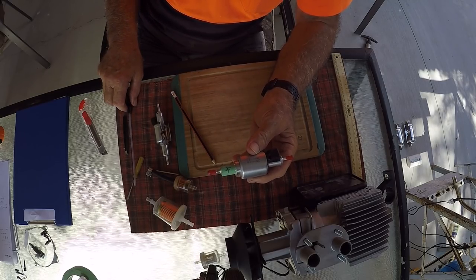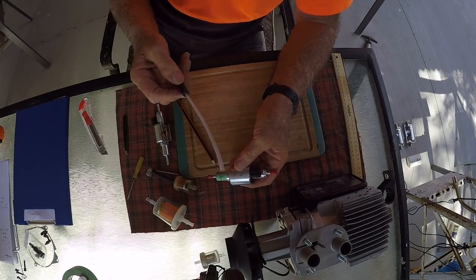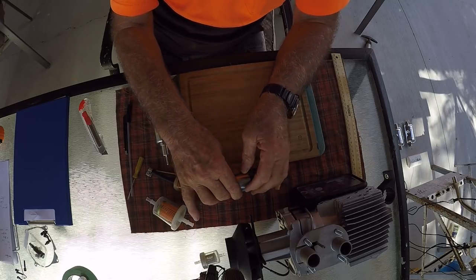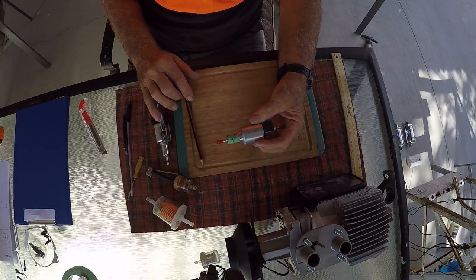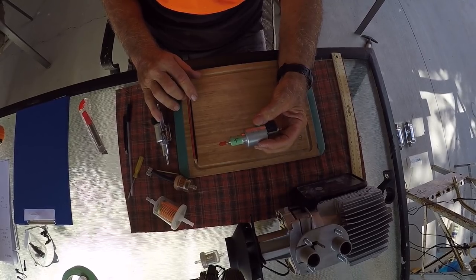When you mount them, you rubber mount them to isolate that noise, and you also isolate the fuel hose. All right, I hope that helps a little bit in your understanding of these metering pumps, and helps you in your own installation and understanding of these little diesel air heaters.